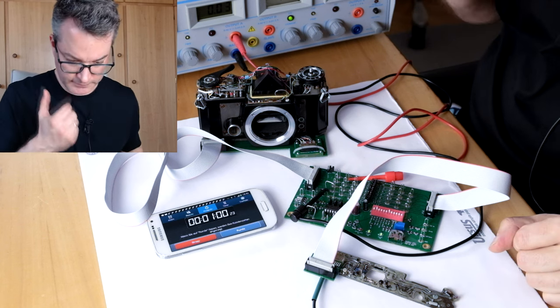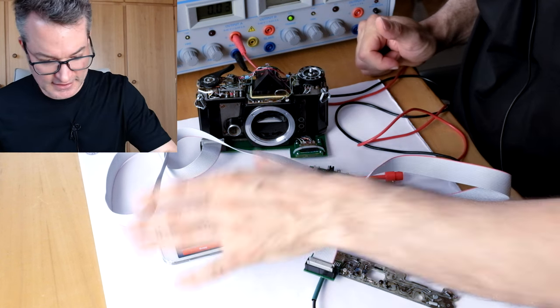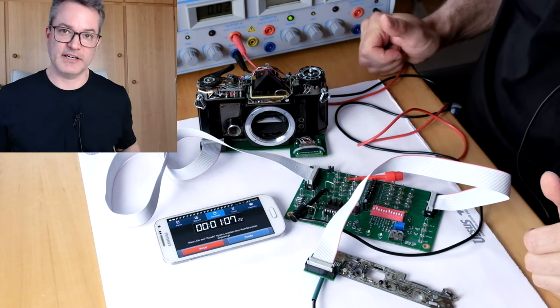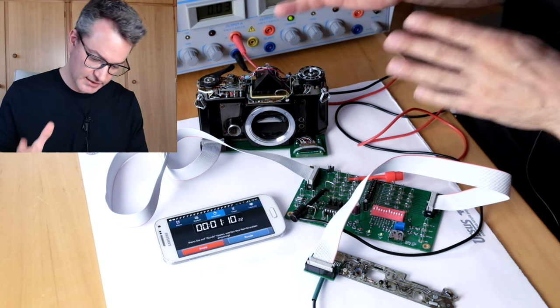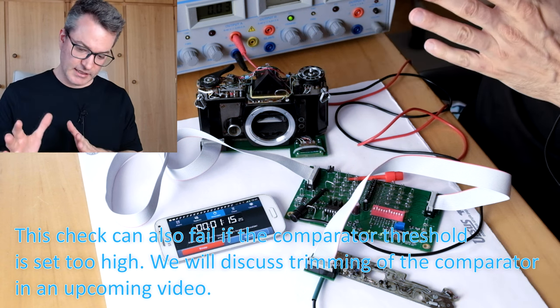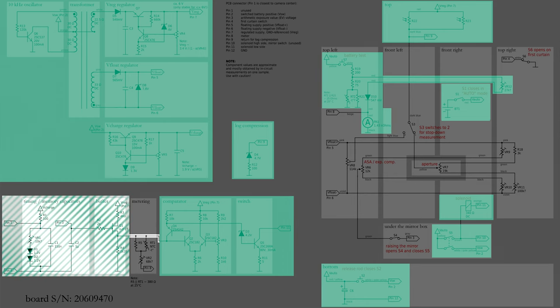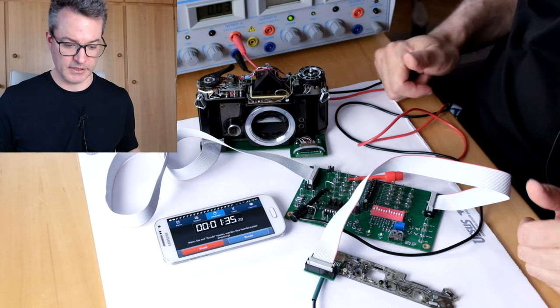Let's wait a bit. Exactly at one minute. So that's a very good sign that everything in the output section of the circuit is working. It indicates that the comparator is working, that the switching transistor is able to switch the current in the solenoid. And it also indicates that there is some discharging action happening that creates this very long time of one minute that we just witnessed.